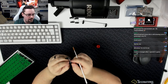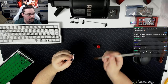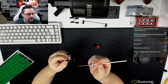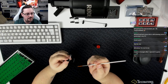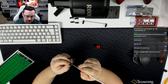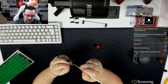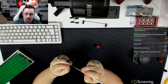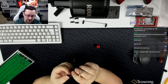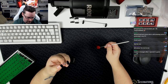Okay, what else we talk about in chat? I'm still unsure about what lubing technique I prefer. Nathan Kim, for example, uses a lot more grease on his stabs, dips into the tube, etc. Whereas this is quite a minimalist lubing technique. My view on lubing is what you're trying to do is you're trying to take away the rattle from stabilizers, okay? And that's twofold. That's when it's in the board and you're typing on it and you can feel the bottom out, take away that rattle. And then the second thing that you're trying to do is you're trying to take away the actual rattle from the keycap that moves left and right.